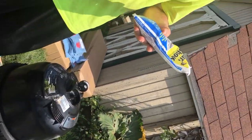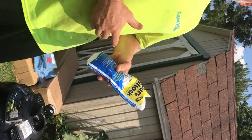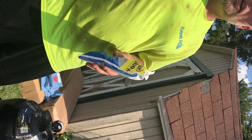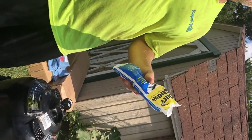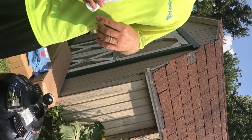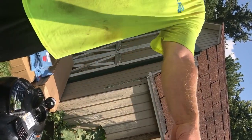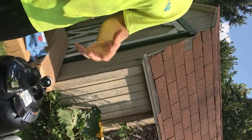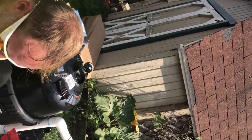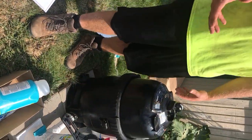This is shock. When you get your water filled and your pump running, cut this open and dilute it in a five-gallon bucket with water first. Don't pour it directly into the pool because if it sits in the bottom it could stain your liner. Use the five-gallon bucket first, then dump it into your pool with the pump on — preferably right over the area where the water shoots out, and it'll spread it for you. My boss recommends doing that about once a month and it'll keep your pool that much cleaner.